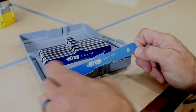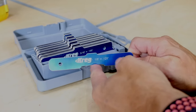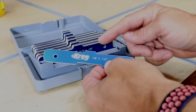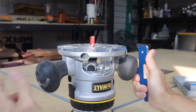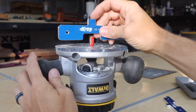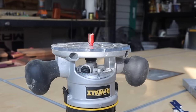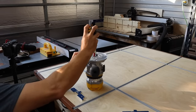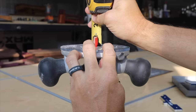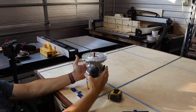What's extremely useful about this tool is they're multifunction. They have a depth gauge — you can check the depth of your cut with that. And then they have a fence gauge. Let me show you how to use them. One of the main uses and one of the main reasons I bought these Kreg Setup Blocks was to set the depth of my router bits. Before, I was trying to use a tape measure to do it, and you just can't seem to get it accurate.